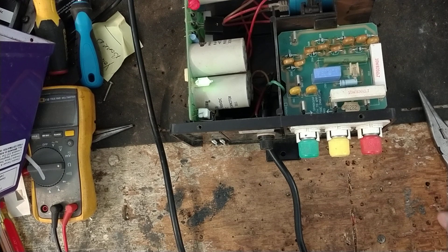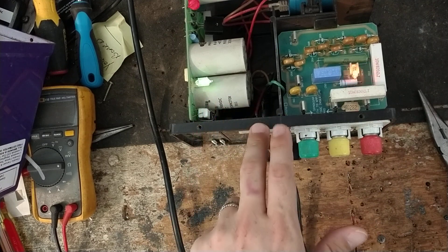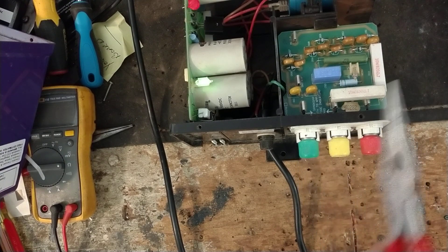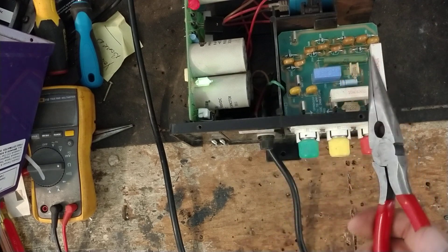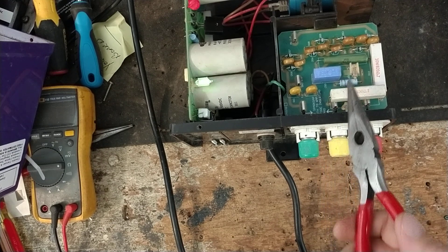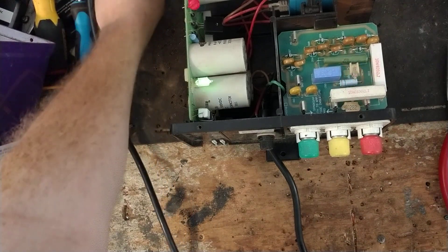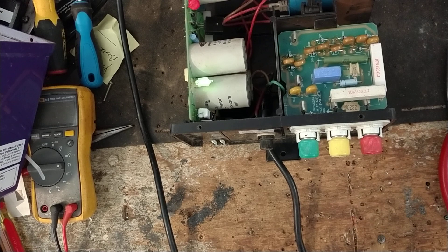There's one other test you can do, and it usually works well on a Gallagher M800, M1500, BEV3, MPE2. If the unit looks like it's working fine, hook up just the ground system to it. If it still shows good, that means your transformer's okay. But if you hook up just your ground and the light goes out while it still clicks, that means you've got a bad transformer. I call it the ground test. It's about the only brand I really do it on, and it's kind of a last resort test to make sure the unit's running fine.